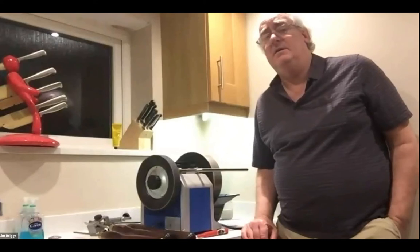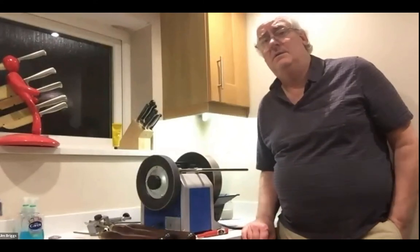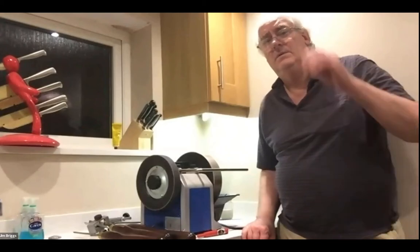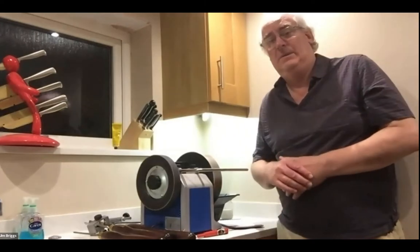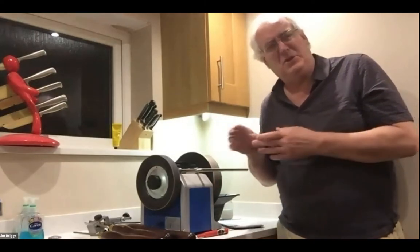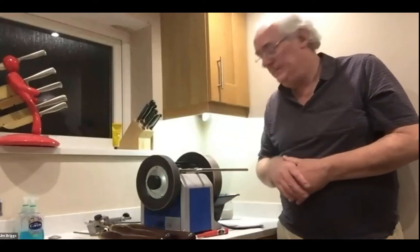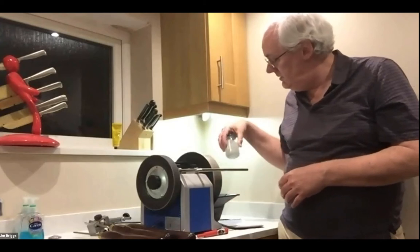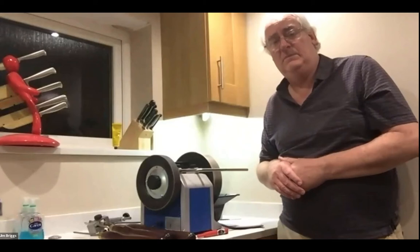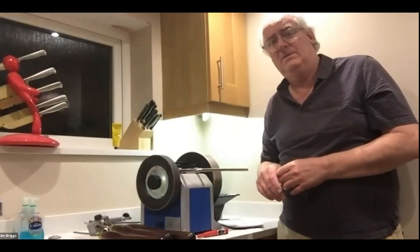I haven't, Terry. You can run both CBN and diamond dry. I would have thought so, because you don't need the water for cooling. The swarf goes somewhere else, and it goes into the water down there. What the water does, I find, is keep the wheel nice and clean. But I don't think it's needed, especially on a slow speed one like that. I don't think it's needed for cooling.